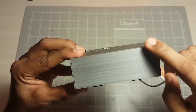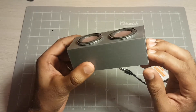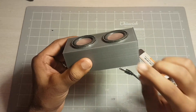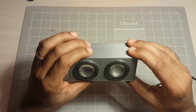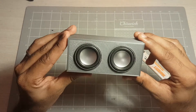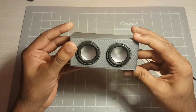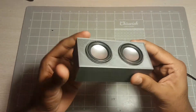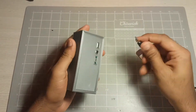I printed this at around 0.28 to 0.3 layer height — I'd have to double check, maybe 0.32. I didn't use a very low layer height. Remember, the lower the layer height, the finer the quality. There wasn't a lot of detail in this print, so there wasn't a need to go high quality. That's why I went for a slightly higher layer height, which reduced the printing time by a fair amount.